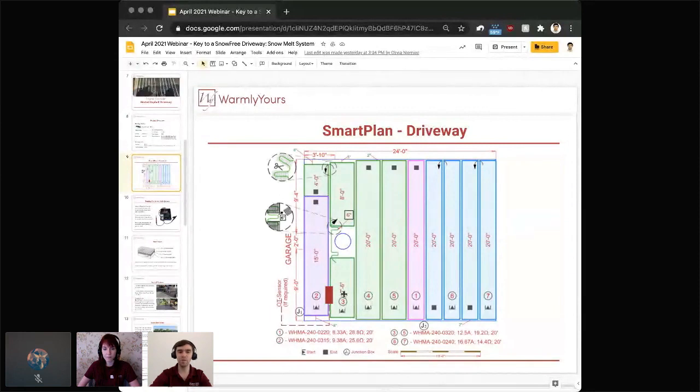This is where you run it for 7 feet 6 inches, then remove the mesh without cutting the wire, you're just removing the mesh. By doing that, you get a free form heating element that you transition around that fixture here and continue going up for another 8 feet, making your U-turn, another 4 feet, and you get your area covered. So this is not your easiest layout because you have some free forms and some turns. If it's a simpler layout where mats can be used in their full length without cutting and turning, the whole installation could be even easier.